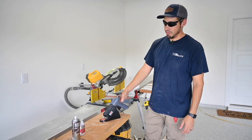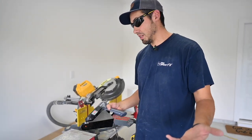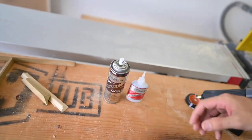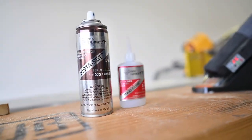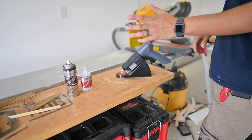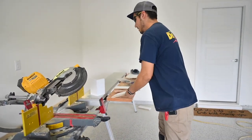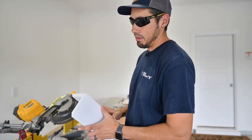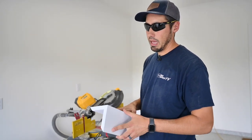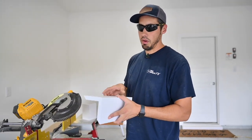I was very impressed by this stuff and we've been experimenting with it ever since. I actually like it so much that we started selling it. You guys know we already sell our CA glues, and these are really good especially for small little returns, like cove moldings and little edge moldings — gluing that stuff together. Or even anything that has to do with MDF. But when you have such a long joint that's actual wood, I'm not going to use CA glue. You can get away with it, but it's just not as strong a bond — especially with pine, it just doesn't seem to take very well over such a long joint.